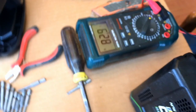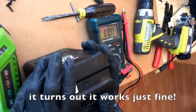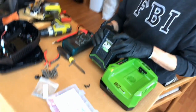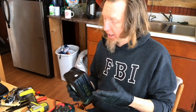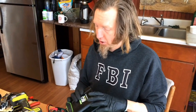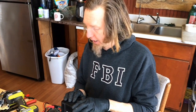It's showing 82.9 volts, which is actually a little bit of a problem because the Cyclone controller has a high voltage cutoff. So that means one of two things: either you do this setup and just make sure you don't charge the battery pack all the way up before you plug it into the wheelbarrow, or you charge your pack all the way up, stick it on any of your power tools, run it for probably a minute — it'll drag it down to 80 volts — then pop it out and throw it in the wheelbarrow. That's only with a fully charged battery that you'll have to do that.